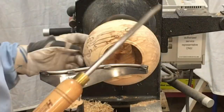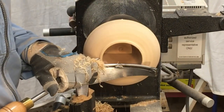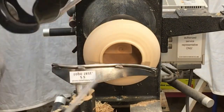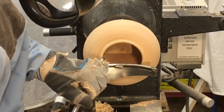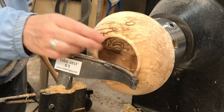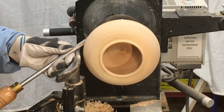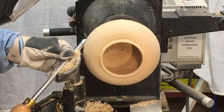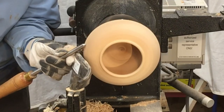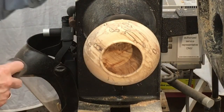I finished hollowing it out, and I'm just going to clean the rim up with my small bowl gouge, round it over, and try to get a kind of clean cut. A little bit of shear scraping with my 3/8 bowl gouge. That really does leave a fantastic surface. It took me a while to get the hang of it, but it did a really nice job on this